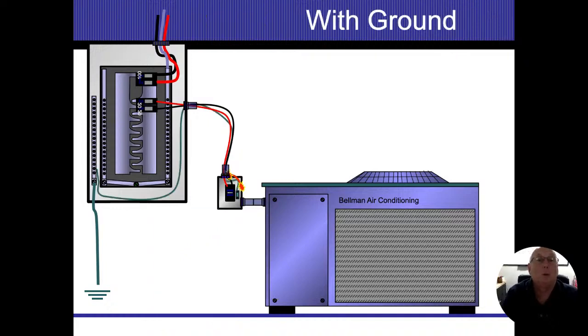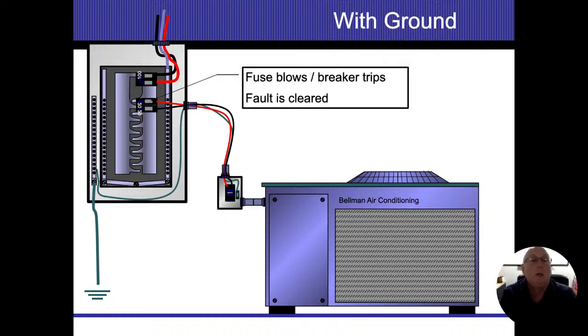So now we took a green wire, we ran a ground to our grounding bus bar. We do have our bond inside there as well. So now that wire comes loose and energizes our case, which is going to energize our ground wire. Because that bond screw is there, it's going to now energize my neutral bus bar. That neutral bus bar allows for no resistance whatsoever. So we're still going to have 5 amps go down the grounding electrode conductor, but we're going to have unlimited amps going up the neutral wire.